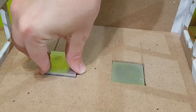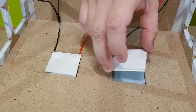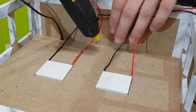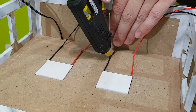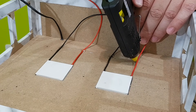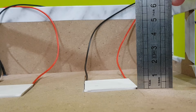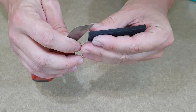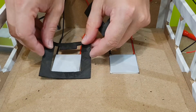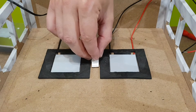I've handled these aluminum blocks with my greasy hands, so after I place them in position they need to be cleaned again. I've made two grooves on the MDF panel under each Peltier module so the wires will not be pressed. I will stick the wires to the panel with hot glue, but in a very low place where they will not be touched by the hot radiator. The MDF and insulation from the back panel have a combined thickness of 12 mm, but the Peltier modules and aluminum spacers are 14 mm thick, so around 2 mm of the Peltier modules will stick out from the MDF. This is a 4 mm insulation gasket for Peltier modules. I will slice it in half because I need 2 gaskets with a thickness of 2 mm. The tiny hole between the modules is for the center screw of the cold radiator, so I will cover it with a piece of self-adhesive foam tape.